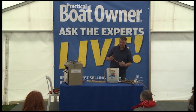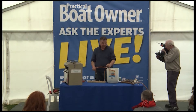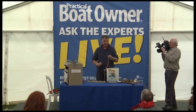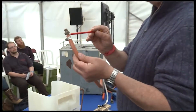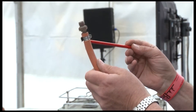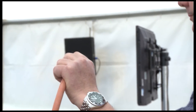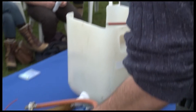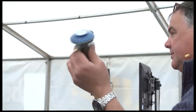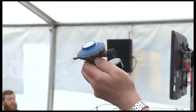Another one I've stripped out recently — there was just a hose on the boat side of the gas locker. These are actually hydraulic hose fittings. They're not gas fittings; they're not designed for purpose. And while we're on this, jubilee clips or worm drive clips are not the best in securing hoses. Also, regulators I've taken off recently — that's the spring rusted through. This regulator was giving about eight times the pressure down to the cooker than it should have been.